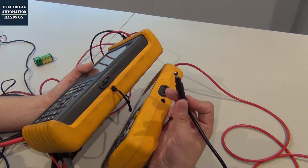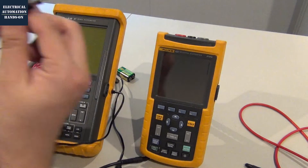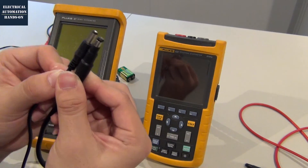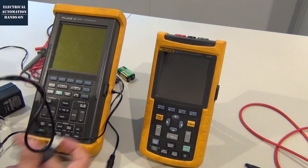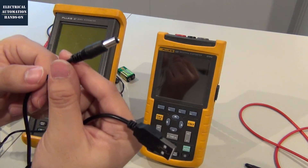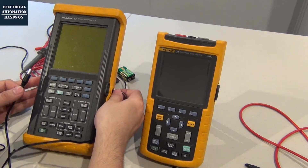Like this, I made this power supply by myself and it supplies 12 volt and 300 milliamp — make sure it is greater than 300 milliamp. As we can see, this is a standard connector of the PM8907. To DIY the connector by yourself, you need to select one connector like this — it's straight. Comparing the sizes, they are similar like this. This is very easy to find. A cable like this — one side is USB, one side is this connector — is very commonly used for router or switch power supply connectors.